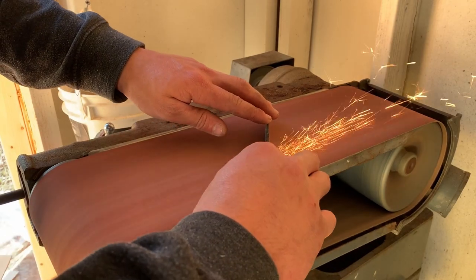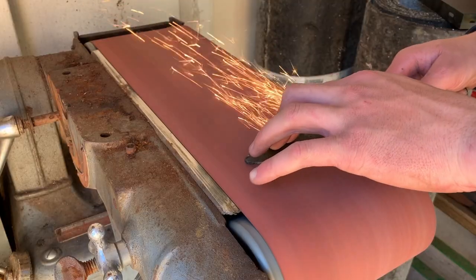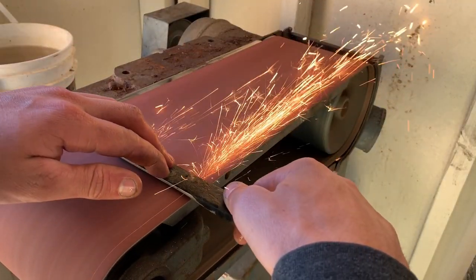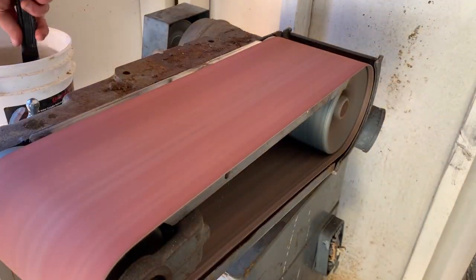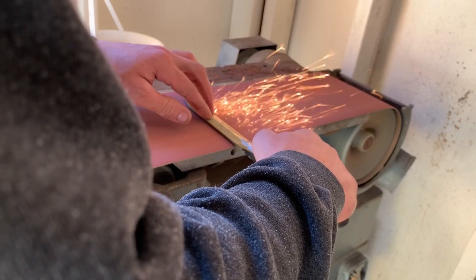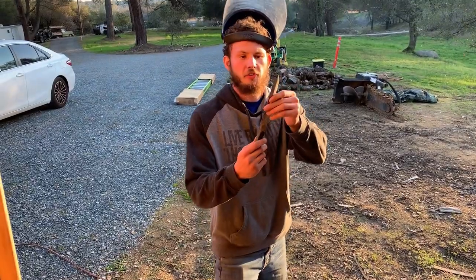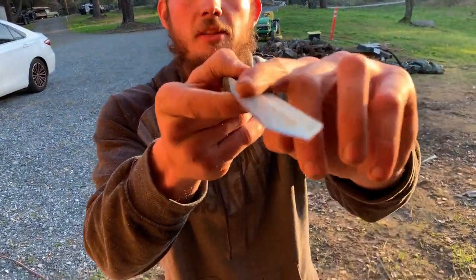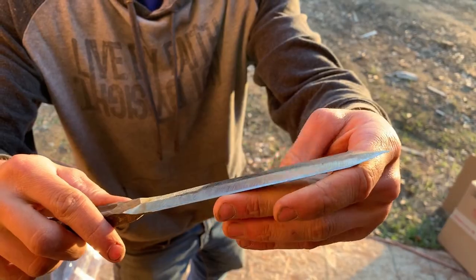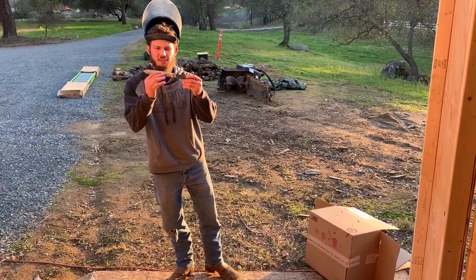And now for some grinding. Basically I'm doing a double bevel on this. Right now I'm setting that large bevel, removing quite a bit of material. The hardest thing about this is keeping it perfectly consistent because we are repeating this bevel. You saw the first bevel being ground to give it that peak in the middle — did that on both sides. And we did a very small little bevel for the edge. Not the greatest edge, but it'll do for now. Going down the tip. There she is — in practice, it's a pretty effective knife.